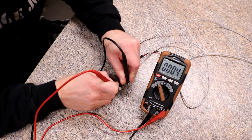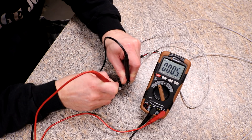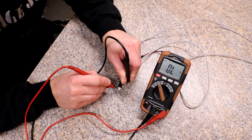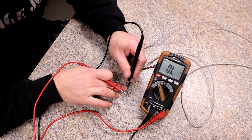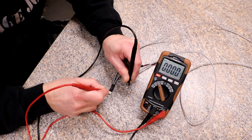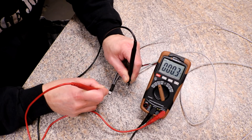I have one ohm on the blue wire. Now checking it over to the yellow wire — no connection there, which is correct. And there's the yellow wire connection. So this extension is good.